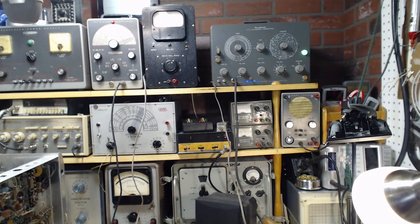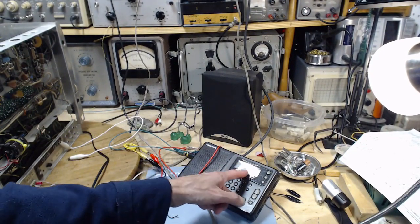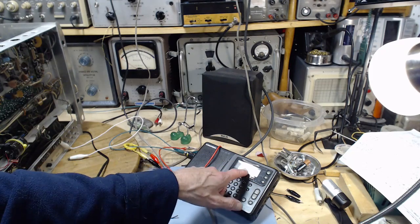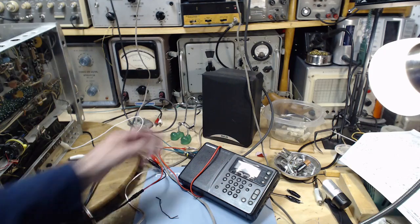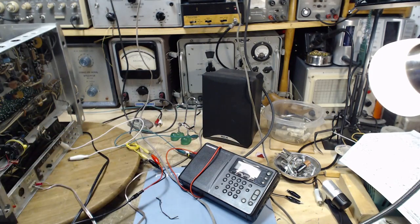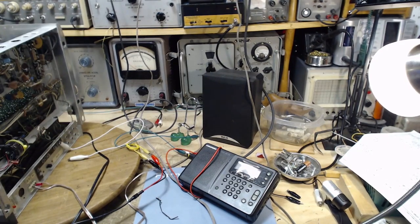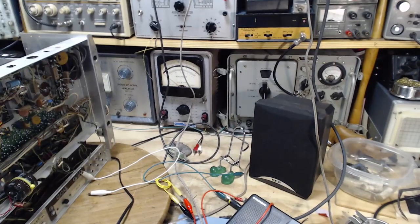So what I've done this morning, in order to find out about those two pieces of equipment, is I brought in a radio with a digital tuner. You can't read it there, but it says 108. That's the top of the FM band. And then I've just got the antenna from this radio just laying here on the bench to pick up signals from the two signal generators, so I know what they're doing. So let's do it again.